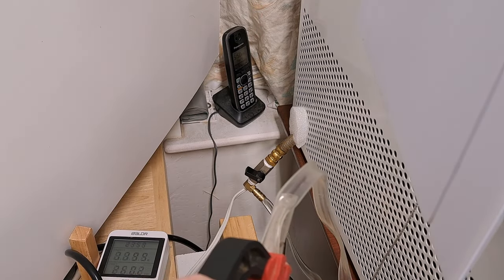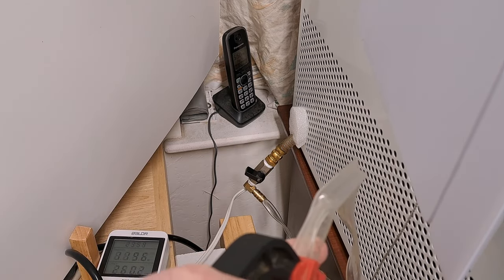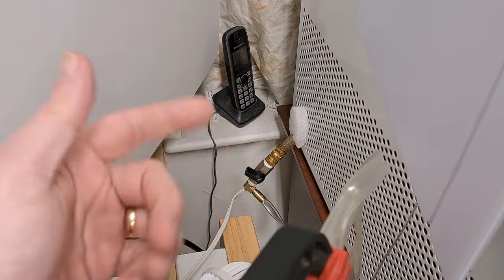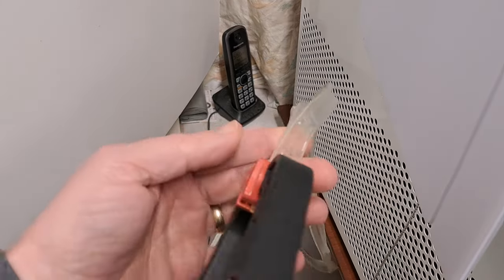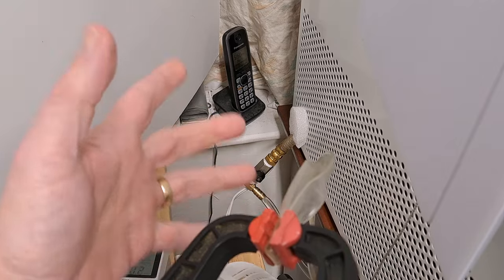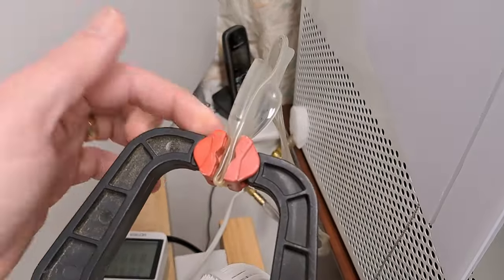Let's see, it achieved 2,500 millitorrs in about 4, 4.5 minutes. Maybe it's 3.5 minutes. Anyway, we didn't record it because everything went so well. And then it achieved 500 in about 7.5 minutes, which seemed about a minute slower than typical for the 500, but it seemed okay. I checked the hose, so I decided I'd clamp it to make sure.